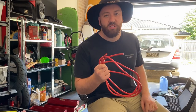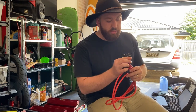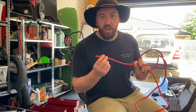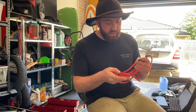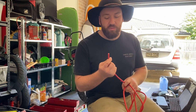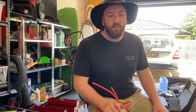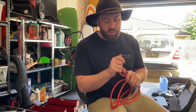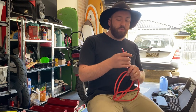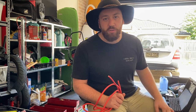I just wanted to take a second to talk about wire sizes and current. This wire came in the kit - when I measured it up it's not quite six gauge but it's also not eight, so it's somewhere in between, roughly a seven AWG. This is not the thickest cable you could use - some people put in two AWG which is quite thick and chunky. This one measures up to about 10mm squared. Because it's not the thickest cable and it's going over a longer distance, we are going to get some voltage drop, especially because we've got two fuses in there with the connections.